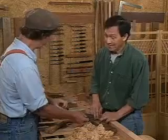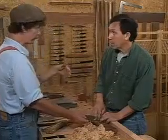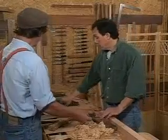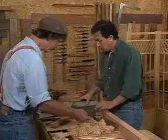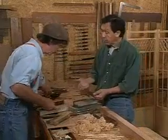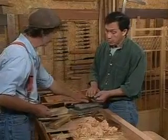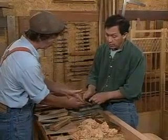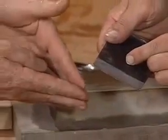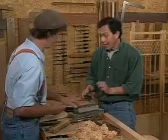That's right, Roy. Could you show just a little bit about that? I know, as in Western sharpening, you're just going from one abrasive from coarse to finer, but could we go to the final stone? That's correct. I use a series of, actually, I'm now using ceramic stones to create the geometry that is the sharpness, which is one flat plane intersecting another flat plane. So they really just have to come down to that last point. Exactly. Two straight lines converging, and that's the cutting edge. Converging, and ideally it's infinitely small and very smooth.